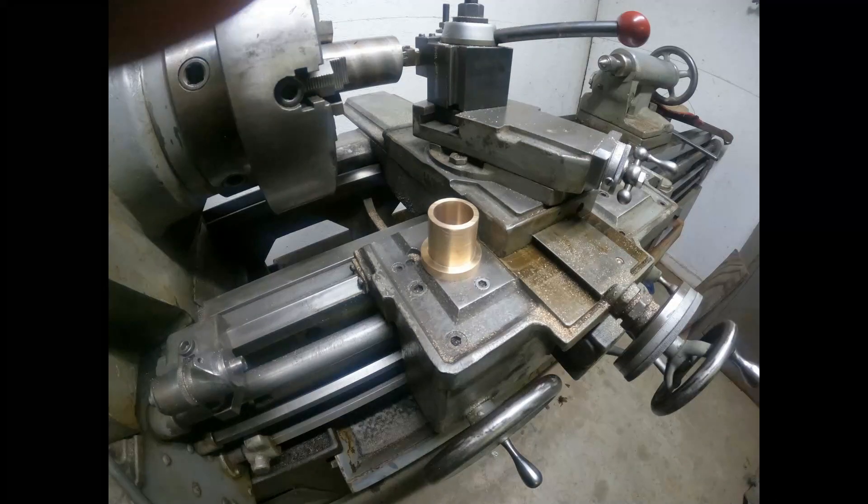Here's a picture of one of the bushings after I made it. It's inserted from the inside of the piston, and the wrist pin runs in the ID of that bushing. Bronze is the material of choice here because it's very hard, resistant to wear and compression — this is going to get a lot of force on it — and it also carries oil very well, which is something that brass just does not do.